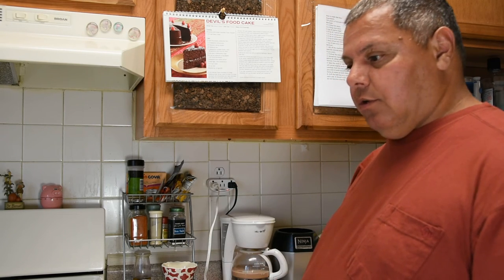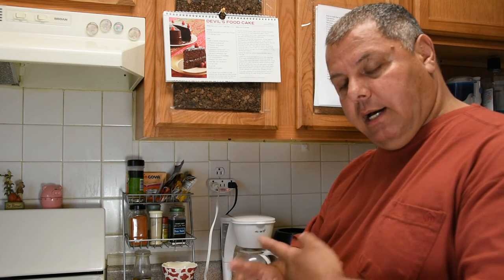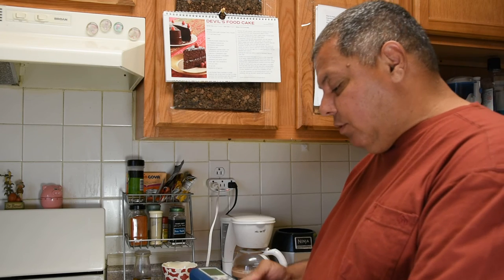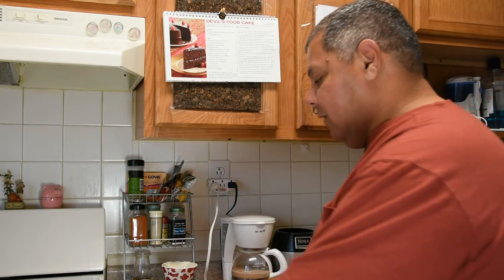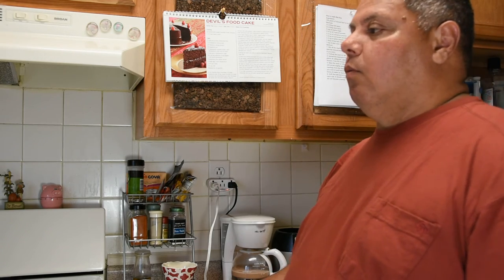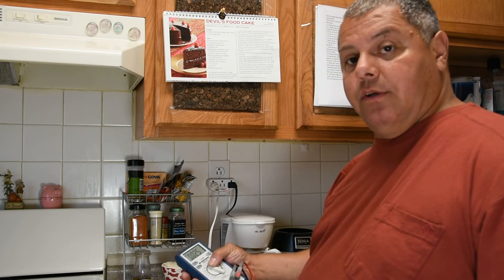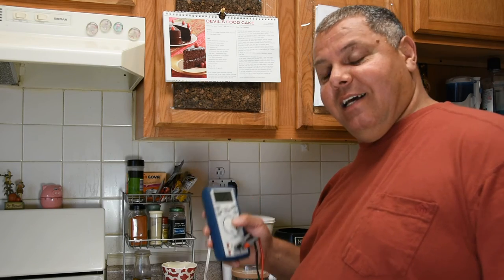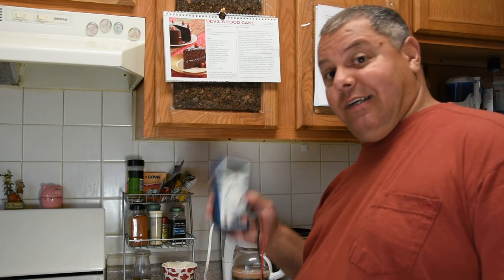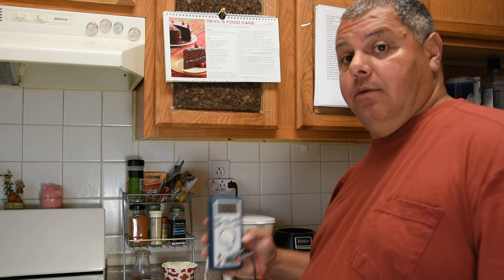For a homeowner, a good meter will pay for itself and get you out of trouble. I'm not breaking down outlet wiring today — I want to do that properly, covering line, load, three-way wiring, and how to wire an outlet correctly, in a separate video. Most people don't need a full multimeter — a wiggy with a digital display and True RMS would be great. But for my diagnostic work, I also use this for HVAC — it tests capacitors for the fan and compressor. Some dedicated capacitor testers used to cost $100; this does it for under $100.